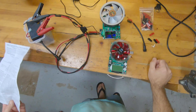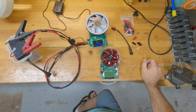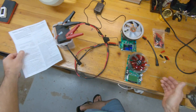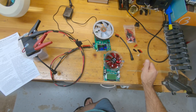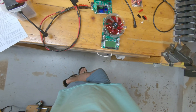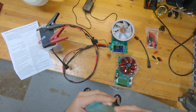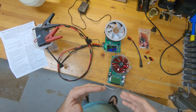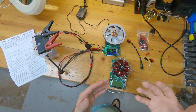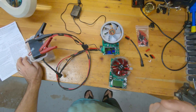Hey folks, Roy here. I just want to do a quick review of these two battery testers I recently picked up to test capacity of various batteries — sealed lead-acid, regular lead-acid, AGM, lithium iron phosphate, lithium polymer. My main purpose is very low amp draw, 0.25C discharge, to see how many amp hours capacity I can pull out of the battery to its safe low voltage cutoff.